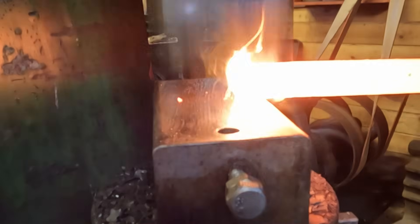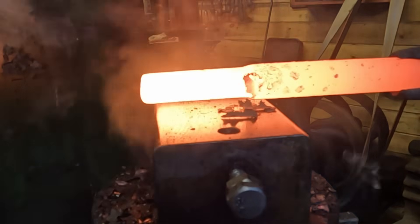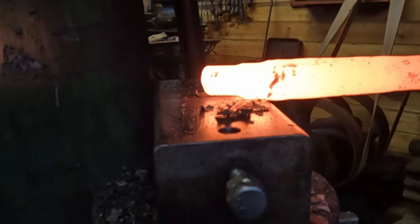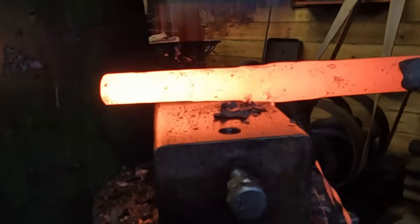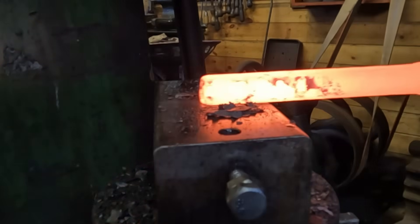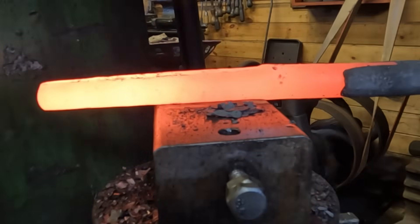That is going to begin in the forge where we make the blank. The first step is to break down the stock into a more useful size. This piece is about three-quarter inch round and actually an old hinge pin from an access platform — a good friend of mine gave me a box of them years ago. In the normalized state, the steel is tough enough to resist hammer blows, hard enough to resist wear and scoring, but soft enough to be just fileable and machinable. It's probably an EN8 grade or something similar.